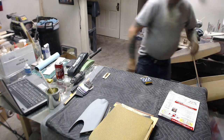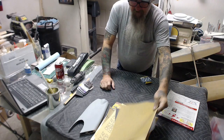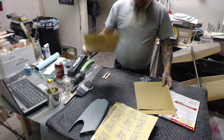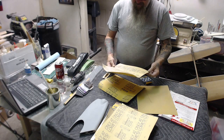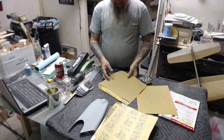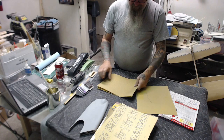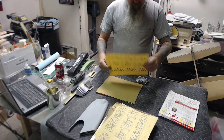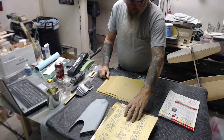Of course, as far as hand sanding goes, these are the papers that I've been using. These are 3M. It's a well-known brand name, 220s. This is a Lowe's product. It's a gold open coat. And for the money, this is probably the best sandpaper out there. It's $7 for 5 sheets, but these last 3 times as long. So these are really good. I get that in, this is 80, I think. Yeah, 80, 220. I use a lot of 80 grit.